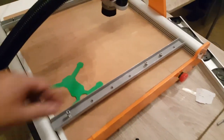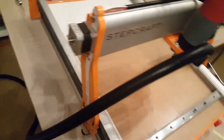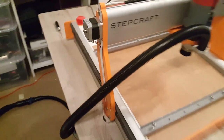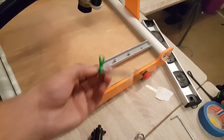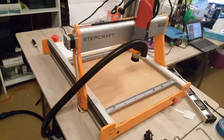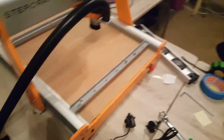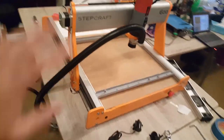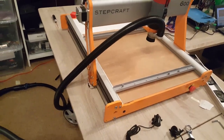Anyways, this is going to be pretty fun and interesting. So far I do like this machine — it took 12 hours to set up, then four hours the next day to align, and I'm on the third day now. I did my first test cut yesterday and my first drawings. I built a little adapter for a marker and did my test alignments — everything's okay. I still can't run 100% jog speed; it catches towards the end and towards the back, so around 70% I'm totally fine.